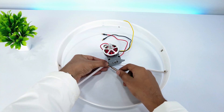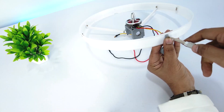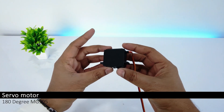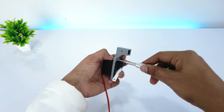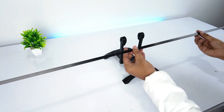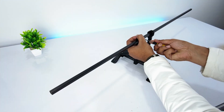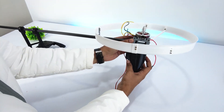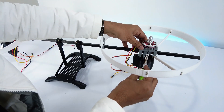Additional parts are attached and connected with the motor mount. The idler mount is connected using M2 screws. I'll be using a 180-degree MG995 servo motor, housed in its mount using M2.5 screws. This is a 10x10mm carbon fiber pultruded tube of 1000mm length. Place it between the center of the battery mount and tighten it. Place the support in the motor mount and attach it with the carbon fiber tube — it's a little bit tricky. Then attach the lever arm with the motor mount.